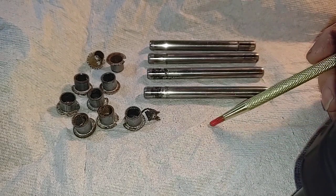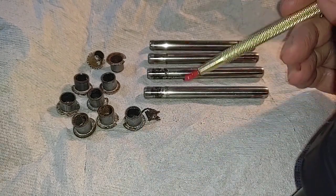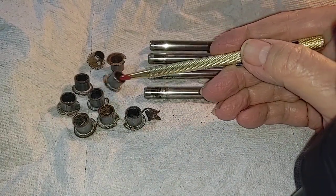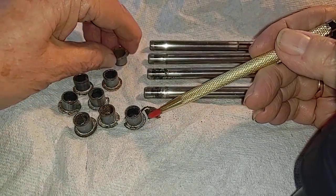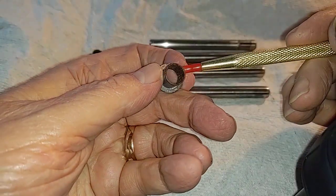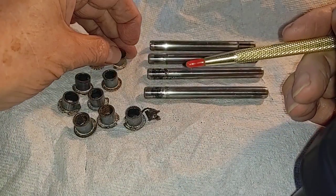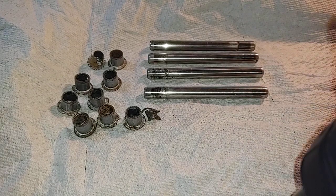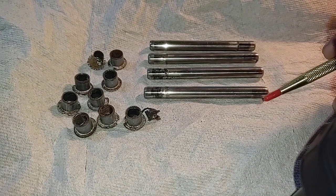The solution — there's the optimum solution, which I'm going to try. I'm going to try and turn up a set of bushings like these out of bronze. The whole question is, will I be able to turn that thin of a wall, that thin of a section? I'm not the greatest machinist in the world, so we'll try and we'll see. If I do succeed, I'll show it to you in the video when I finally — some years from now — get around to putting this back together.